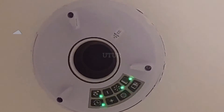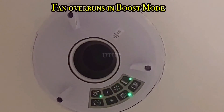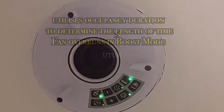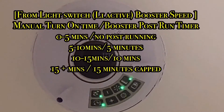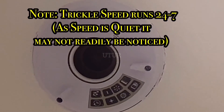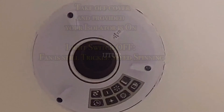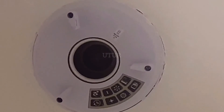The timer smart provides a way of ensuring that ventilation is delivered effectively to your home. It utilizes the duration of occupancy — for example, in your bathroom — to determine the length of time the fan overruns in boost mode, as opposed to a preset generic time of say 15 to 20 minutes. So if you spend 10 minutes in the bathroom, it will overrun on boost for another 10 minutes. This helps reduce nuisance noise, unnecessary running, and heat loss, keeping energy performance as low as possible.